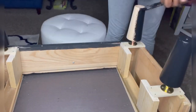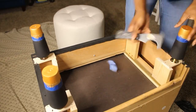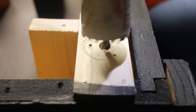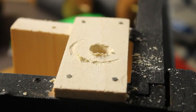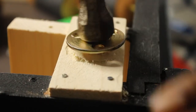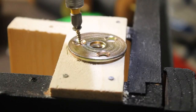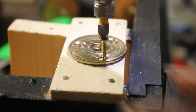The hardware is not correctly inserted into the wood, which I'm about to do now. I did it that way so that when I painted the legs, I wouldn't get black paint on that wood — but I went back later and painted that piece of wood black anyway. It just looked better. You want to make sure that you create a hole in your piece of wood with a nail prior to screwing in, to avoid splitting the wood.